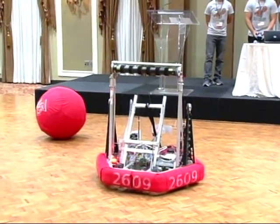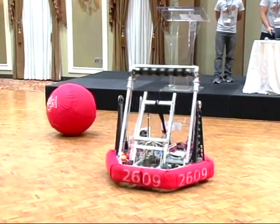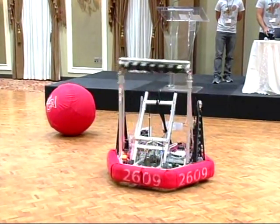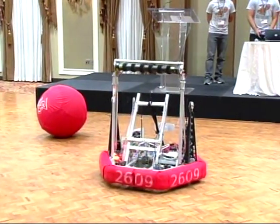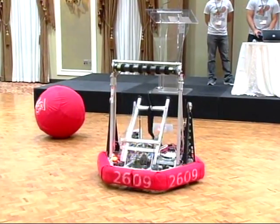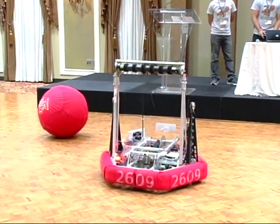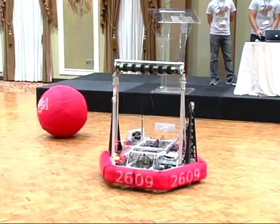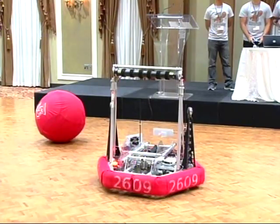Another thing on our robot is the ball retrieval system. So you have the arm moving back, and you have the arm moving forward, and then we have the launcher. So back to the limit switch. If I hold down this button, it'll winch the launcher, but it won't go anymore until I hold down the other button. And the reason for this is so that there's no misfire. So if somebody is in there when they're not supposed to be, the launcher won't launch.